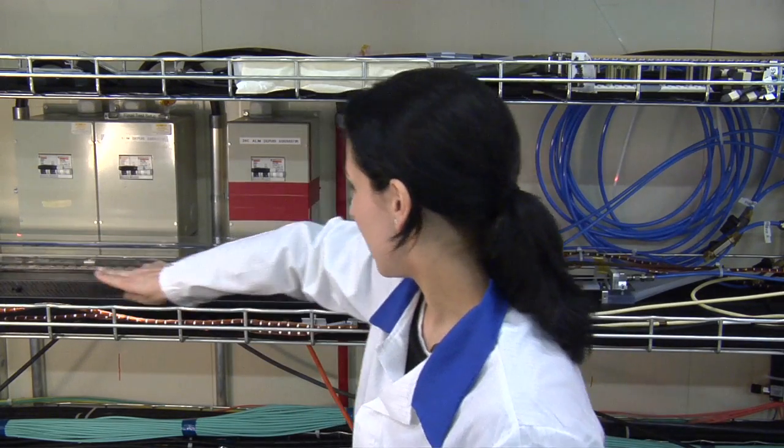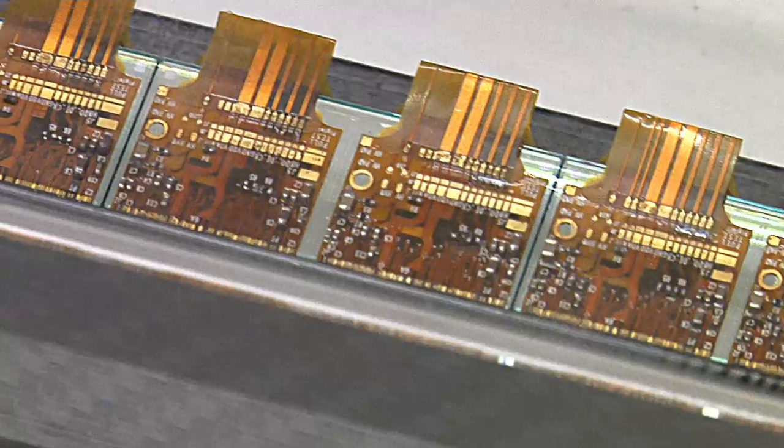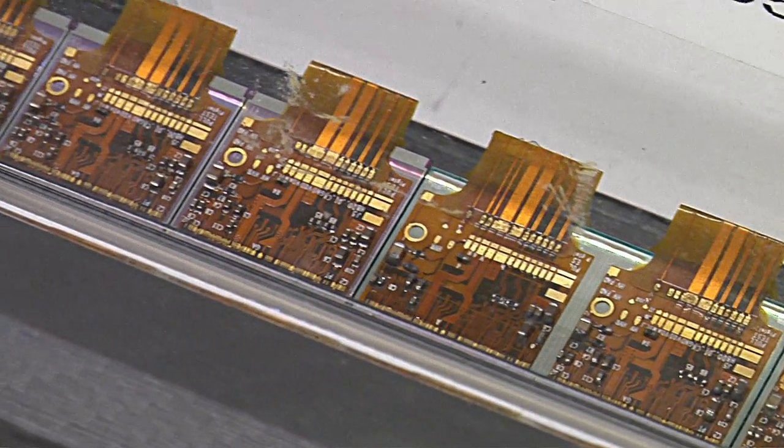You can see 32 of these little chips, which have a front-end chip that does the readout. And then you have a sensor mounted on top of that. There are planar sensors and 3D sensors. The planar sensors are actually based on the planar sensor that was in the pixel detector — it was reworked but the ideas are based on that sensor. The 3D sensor is a completely new technology finding its first application in high energy physics; with the IBL, they have never been used before.